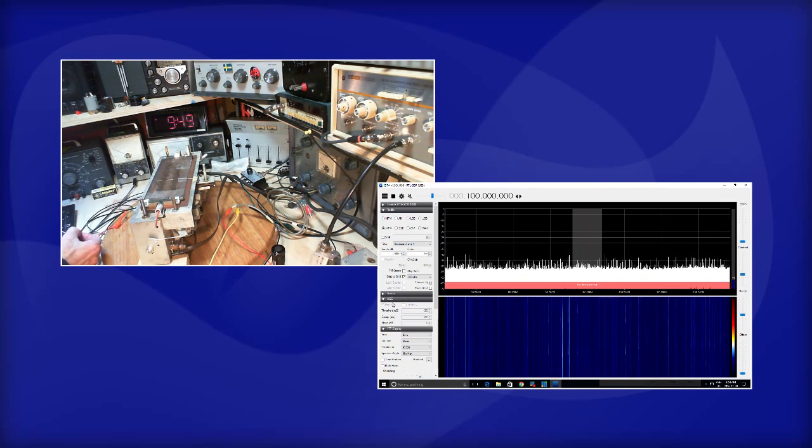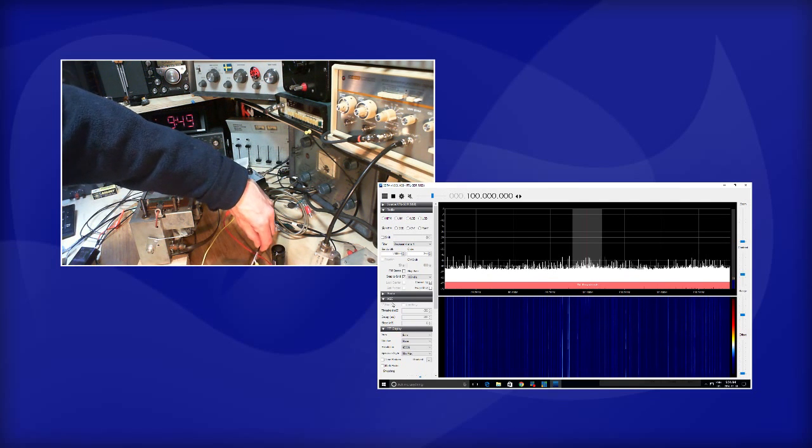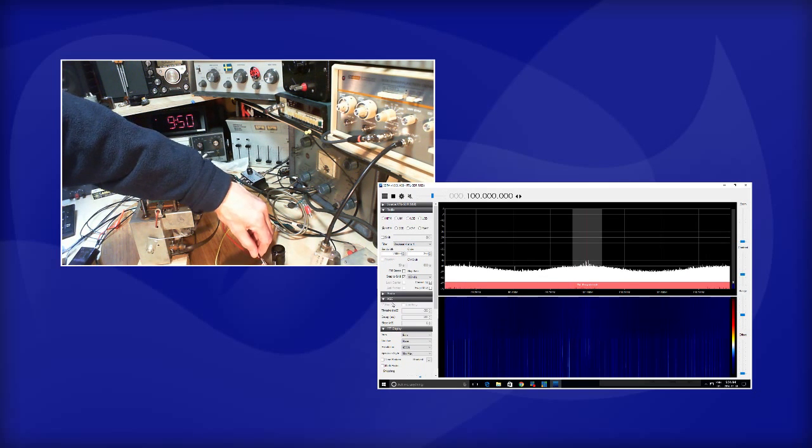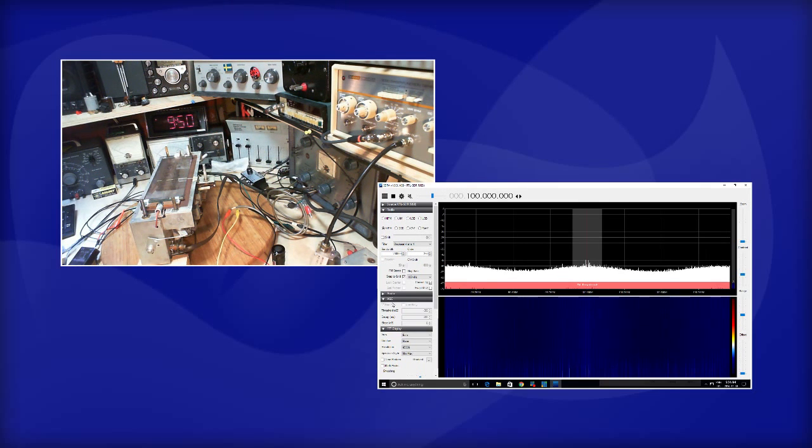So out comes the antenna connection. I've got this hyper-connected here, so let's de-hyper it. Now you get to watch a little SDR action. First we have to stop it. Call up this box, change this from direct sampling Q branch to quadrature sampling. Close it. Move the antenna from the HF spot over to the UHF spot, for everything above 50 megahertz or so.